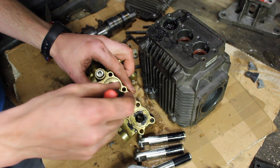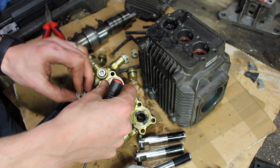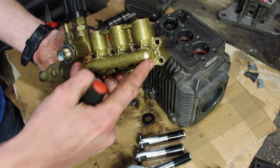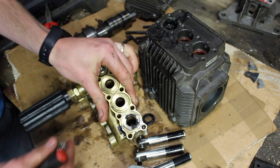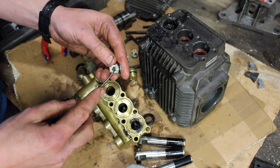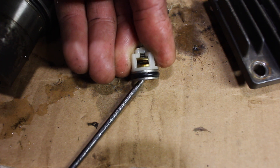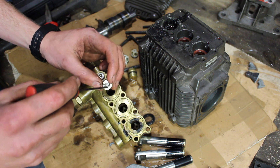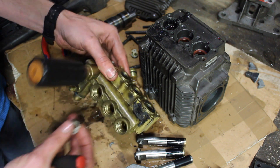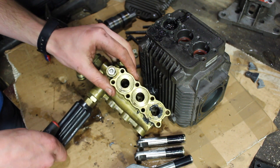At the bottom of the cylinder we have another three set of valves, in the opposite direction to the outlet valves — these control the intake of water. They correspond to the galley here, which is your water inlet. On the intake stroke of the piston it will open the valve, the spring will go back and allow water in. Then on the compression stroke of the piston, it will close automatically. On the outlet side, it will open and allow the water pressure to come out past the unloader and out to your pressure washer lance.